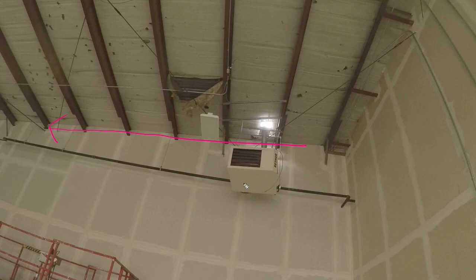Okay, so you kind of notice too the slope of the ceiling. I'm measuring both sides of the sheet for the top, right, left and right, so I can get this slope. I'll always check both sides of the tops. If it's not a sloped roof, I'll check both right side and left side, and then I'll average it out and put the number right in the middle. I'll just write one number in the middle of the sheet so I know what it is.